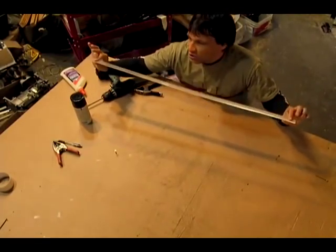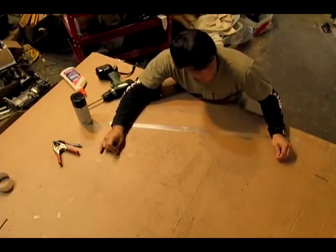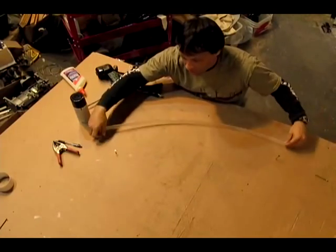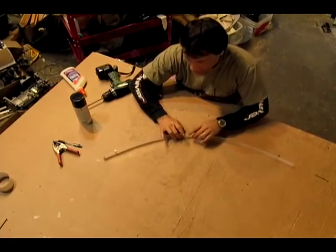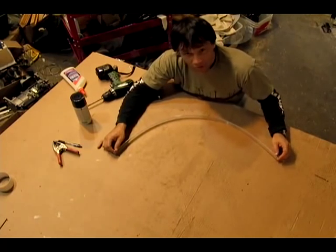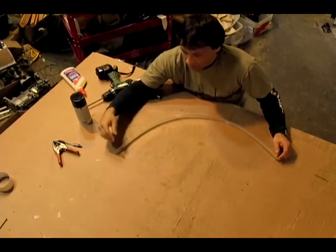The first thing you want to make sure you do is start with the length of your material. I have two screws put in here. Let's say you have a four-foot piece of material — you don't want to put these four feet apart because you're going to run short on material. So you get your piece of material and we're just going to guesstimate right now. By pulling it down, there are two ways of doing this: if you force it down by the edges, you end up with a spherical shape. That's what we used for the parabolic reflectors made out of PVC pipe — that's actually a spherical shape, not a true parabolic curve.